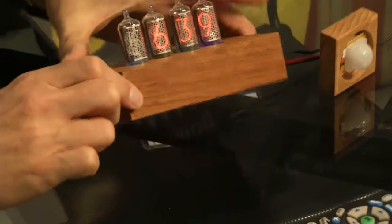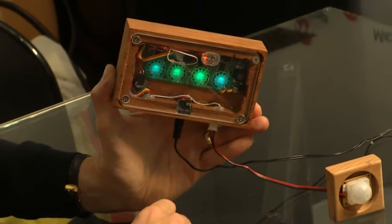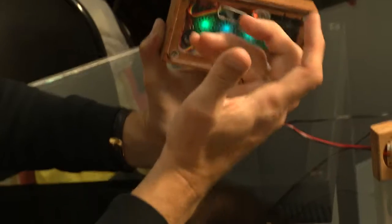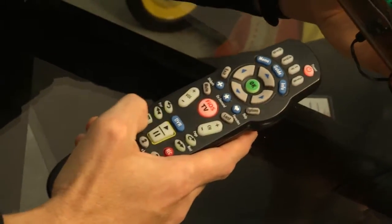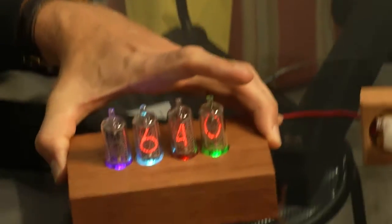I used a PIC16F1509, which that part has 4 hardware PWMs and I2C on it. And I used 3 of the PWMs for the RGB LEDs, and then the I2C bus is connected across all of the 16F1509s. I decided that it would be a lot more fun to do an infrared decoder. And once I determined the carrier frequency, I used a Vishay IR decoder that was tuned to that carrier frequency.